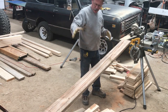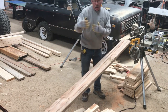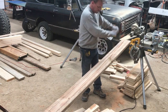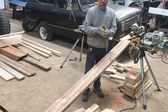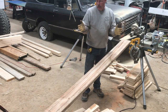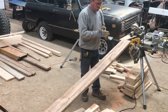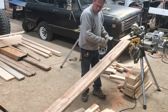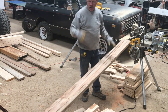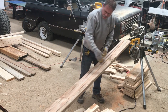I've cut about 3/4 of the way through the board up here, all the way across. Once I have a full board to work with, there's a little flex in it, but not like it would be if it was just two long, 2-inch wide strips up here. Lumber we use in framing isn't kiln dried, so it tends to want to go different ways. If I cut that completely loose, I'd have two pieces wandering off. So this keeps everything organized. I have all my lines still.